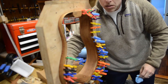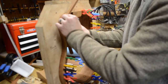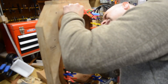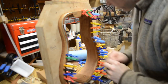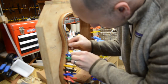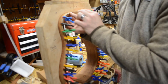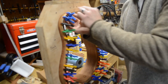You just methodically go through attaching the kerf lining to the sides and constantly scraping out all the glue squeeze-out. You can see here how flexible it is — I'm dry fitting this just to find out how much lining I need to break off. You can literally just bend it and break it off right where it needs to be. If you're a little short, just insert one or two little pieces to make up any gap — spread a little glue, clamp it on, and let it dry. The kerf lining is very flexible once you get all those kerfs in there. The material left between the kerfs is probably only about a 32nd of an inch, so it becomes really flexible, almost like paper, and very fragile.